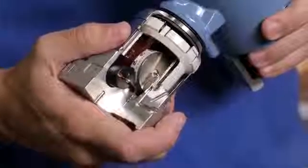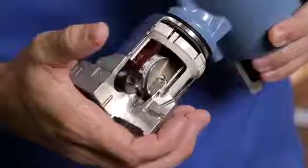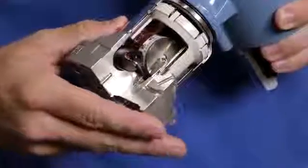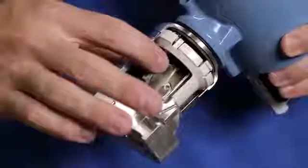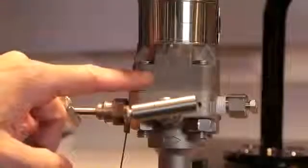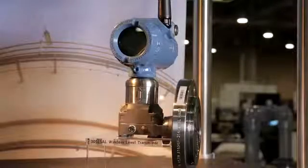Utilizing multiple sensors, as seen here, you'll have access to differential pressure and static line pressure. The static sensor is offered in either a true gauge or absolute and is completely independent from the differential pressure sensor. Also equipped with an industry-leading coplanar design, the transmitter is offered with any one of Emerson's DP flow, DP level, or manifold solutions.